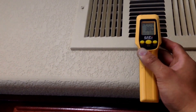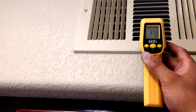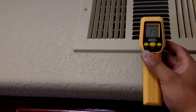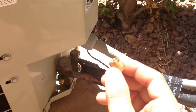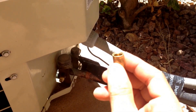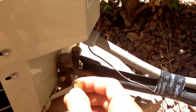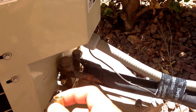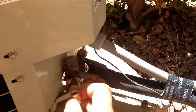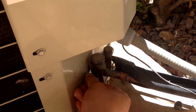Next, come inside the unit and take the temperature coming out of the register. You can see right now we're at 37 to 38 degrees — the temperature will continue to drop as the hot air is sucked out by the return blowers. Once you have determined that your system is equalized, I always recommend replacing your end caps, just as I do with the Schrader valves. These have a rubber seal which prevents pollution or corrosion from the elements outside from causing damage to your Schrader valve.